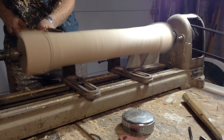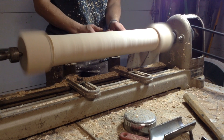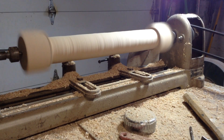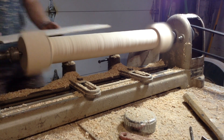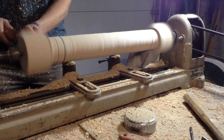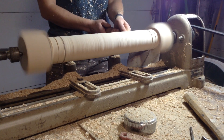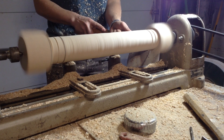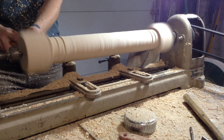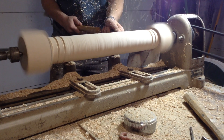I'm not the world's best turner — this is probably a faster, more efficient process with someone else. But I got it to the thickness I needed, which you can see with the calipers. At this point, I'm going to mark where those two beads are going to start. I have my plywood gauge on the side — I can come in with a pencil and mark where those beads are going to be, and then start forming the beads. I could turn a bead with a straight gouge, but I don't have a ton of practice with it, and sometimes that leads to gouging out the wood. So it's usually a process of using other tools to get those beads, but the end result is the same — it's just a little bit of a round-over on each edge.